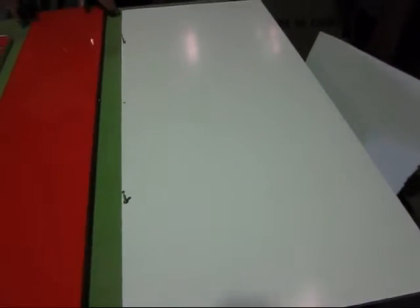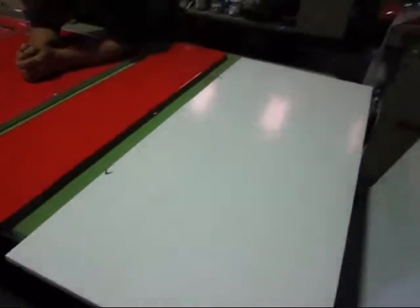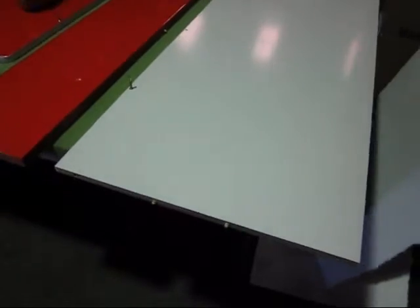Now next, this piece is actually the back of the desk, which is item number 5. With this piece here we put in two screws — one there, two there — and also two wooden dowels at the edge, one there, two there. Now with the wooden dowel, every time we put one in we knock it in — hammer it in 60% in and leave 40% out, like so. And that's throughout the whole procedure. Now we're putting in two there, and we also put two on the other side.